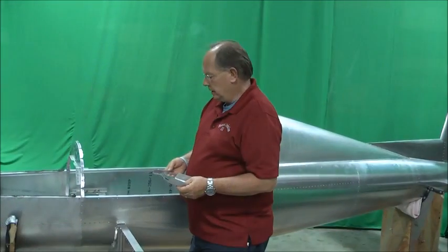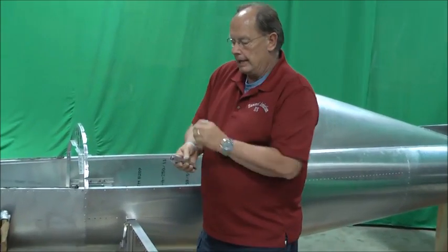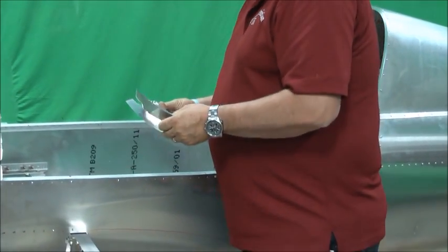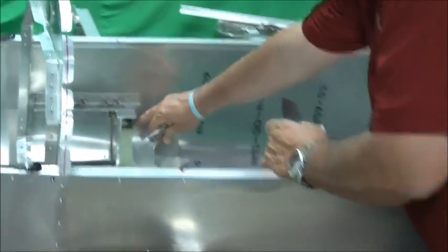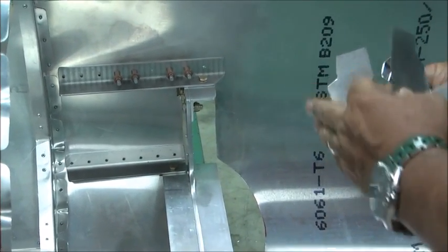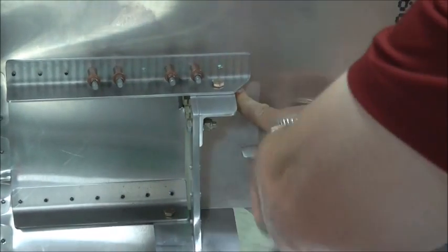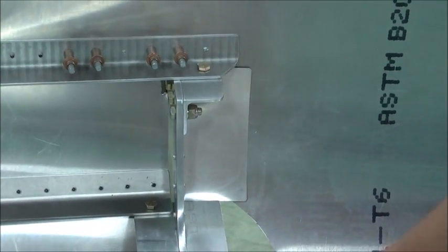Okay, in this step we're going to continue with the spar attached to the fuselage. We've got the 4 little spar attach strips here, and I'll show you where those go. And then the spar cutout covers. There's 2 of these, and basically they go on the inside of the fuselage here. We've got this big gap that we had to leave open to be able to get the spar stuff through. So it'll come just bent. You have to do all this trimming here to make it work. It just goes against the skin and up against the spar, and then we'll cleco and rivet that in place. There's 2 of those, one for the left side, one for the right side.